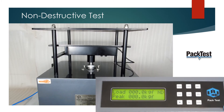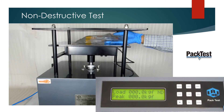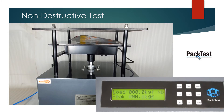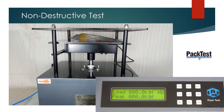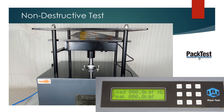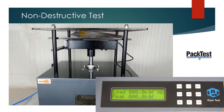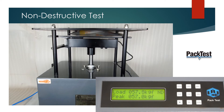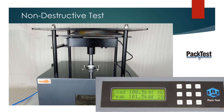Place the sample in the machine and press start. As the pouch gets pressed, the load will be shown on the display. The loading will stop at your defined setpoint, and then a timer will start. At the end of the test period, the machine will reverse back and show a message on the display.